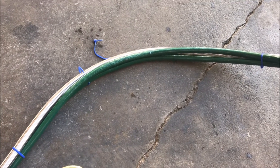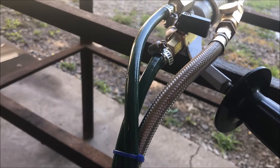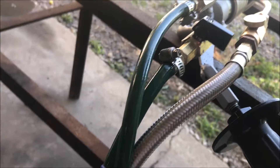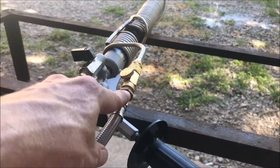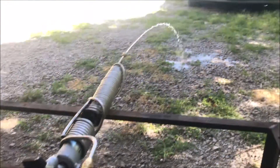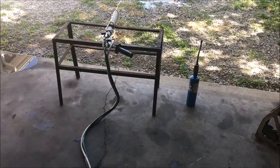You've got to have more time than that to save yourself — that could get ugly. The flame that issued out of that hole would have certainly got me in some way. So here's what we're gonna do: we are going to have to get another one of these braided lines and incorporate that into the design. The reason for a braided line is that during adjustments, a scenario unfolds where superheated steam is blasted back down the line and the boiler is suddenly provided with a charge of water beyond the orifice's ability to remove at the rated pressure.